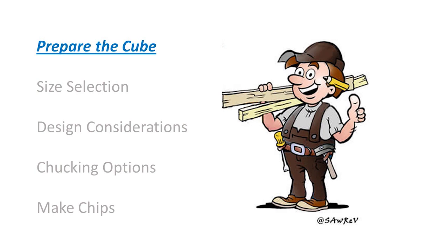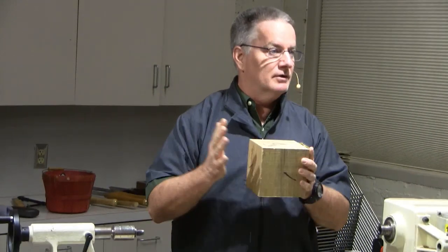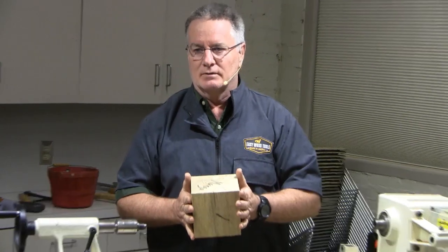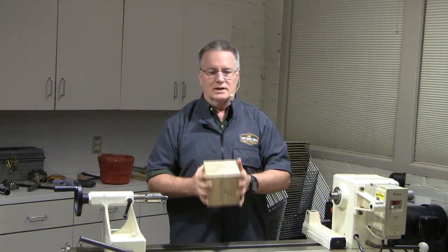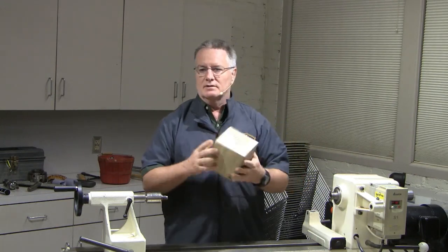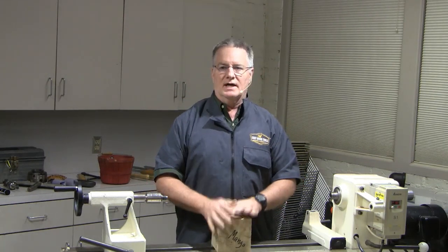And one of the things you have to do if you want this to work out right is you have to start with a cube. A cube is 6 sides, parallel and perpendicular to each other. How many legs is it? 12 legs of equal length. You need every angle between every side to be 90 degrees. The first one of these I ever put together, I slapped a block up on my bandsaw. I do most of this on a bandsaw, and I ripped what I thought was a perfect cube, and I put it on here, and it was the most out of square block.